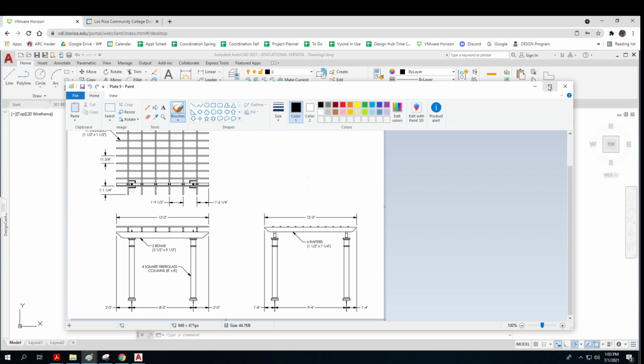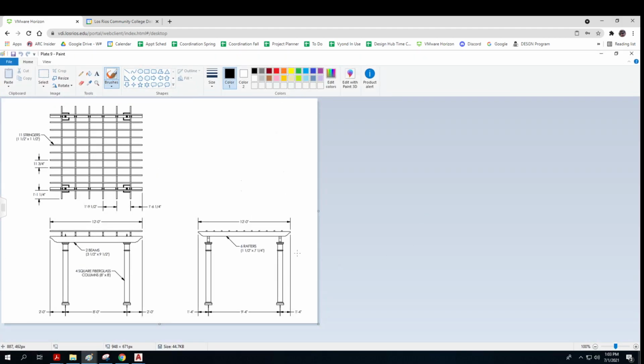The reason it's kind of important to have it is that, at least in the city of Davis and many cities, if you go over an 8-foot span in a landscaping project, and it's an overhead, it needs to be approved on official drawings. They're going to look at the size of your rafter and your spacing and stuff. And it just comes out of tables. You don't have to be a structural engineer, but you do want good drawings.